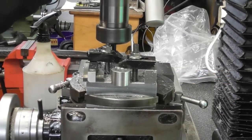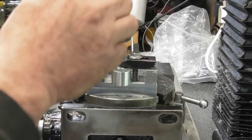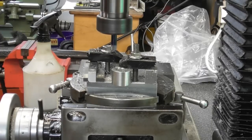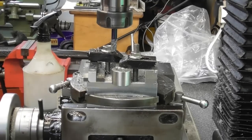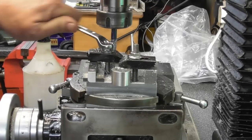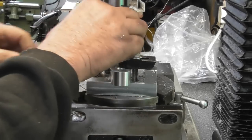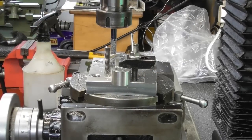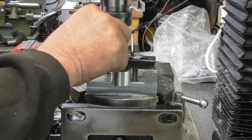Okay, I'm just going to take the cutter up out of the way at that point, and I'm going to remove the complete clamp from this side. That should give me access. Okay, let's just stop that cutter. I've got a depth setting set, so I'm going to be relying on one clamp this time. So I'm going to come back off that dimension and just keep scratching along this space as if I was just milling it conventionally.